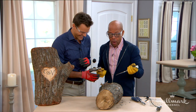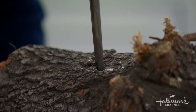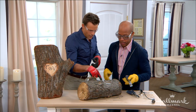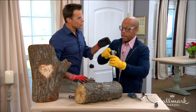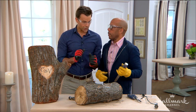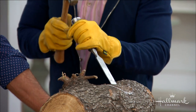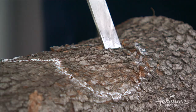The whole reason I'm doing this is so that you can do it! So now I'm going to let you actually try. Once you've done the outline, there are a couple of safety things: when you chisel, you're going to be working at an angle. You always want to chisel away — never chisel towards yourself. As you work around your shape, you move the log, not yourself. You're constantly working away from you.